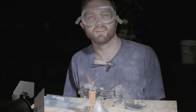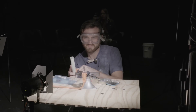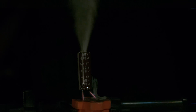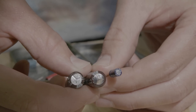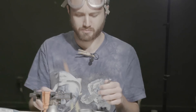That last boom was a tiny little capacitor and we'll try a big one. What do you think — is it gonna be louder or less loud? Three, two, one. Why did the big one not explode as loud as the little one? It's not really a trick question — I just didn't give you enough information. The big caps have a relief valve; the small ones don't. It's an engineered weak point that allows the top to burst open instead of the entire can building up pressure and exploding. Let's blow another big one and face the high-speed camera towards the top. Three, two, one.